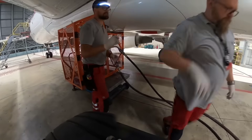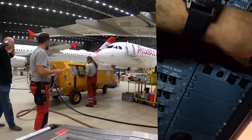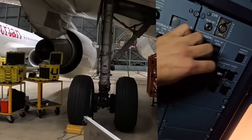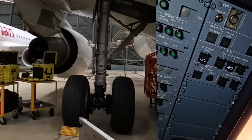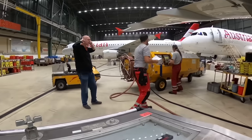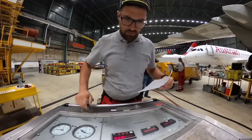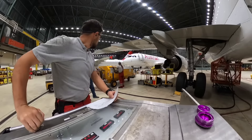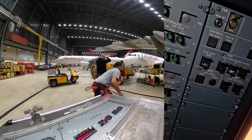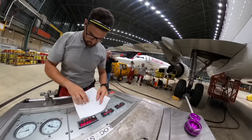Every part of the hardware is installed and we are ready for the test. The first part of the test is performed in the cockpit — my colleague will switch the blue leak measurement off and pressurize the hydraulic system with the electric pump. This way we will confirm that the check valve is not blocked in the open position and that the RAM Air Turbine will not turn. Once confirmed, we'll pressurize the hydraulic cart to initiate rotation of the RAT. When pressure and RPM are stabilized, I'll signal my colleague to switch off the blue hydraulic pump and continue only from the ground.